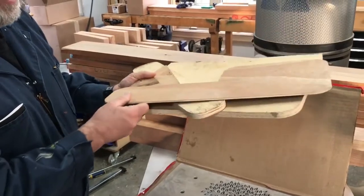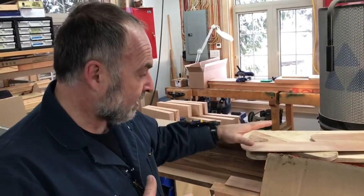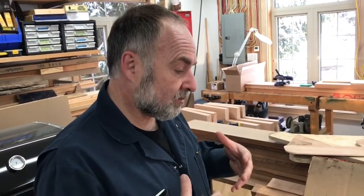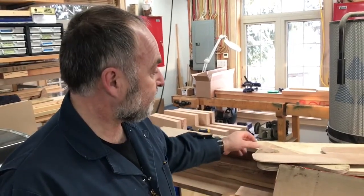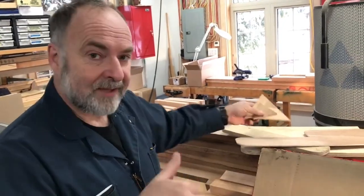These are all the templates here, and our plan is to have these parts cut out in metal — a quarter of an inch thick plate steel — and we're using a service to make that happen. So we've sent these people digital files, to scale, vector files, in full size of all these parts. They plug those files into their cutting machine, and out comes the parts we need, or at least that's what we hope.